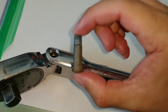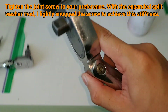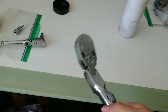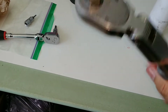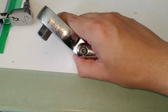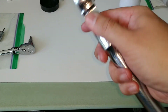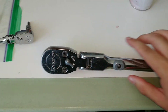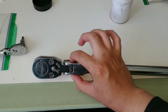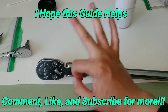After the joint screw is tightened, you're done. In the fully unlocked position, swing the head and it doesn't move at all — that's the trade-off for a tough installation, but you get a stiffer joint. Operate the ratchet and make sure it's fully functional. That's how you remove the locking mechanism, split the joint, and rebuild the head. Take care guys.